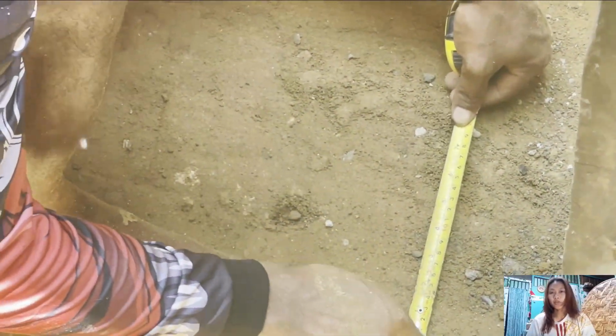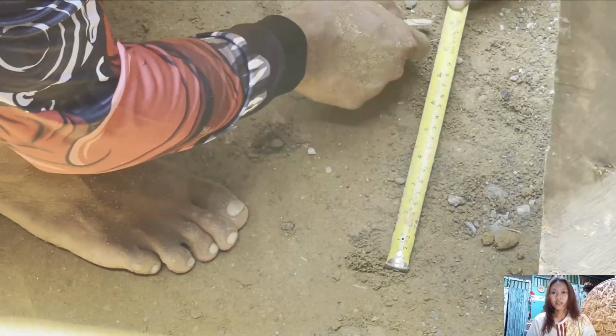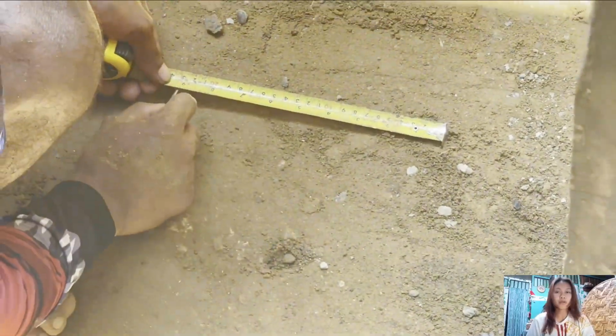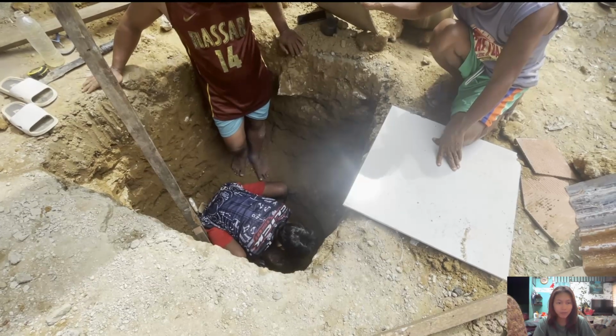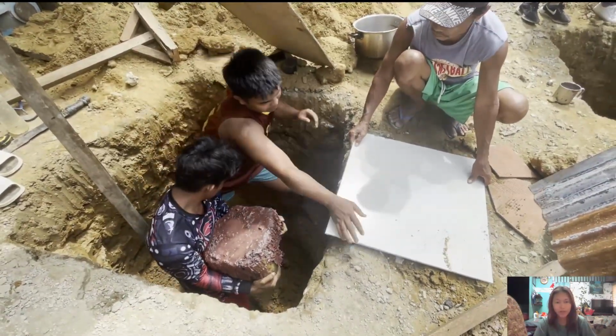After digging 1 meter below the natural grade line, we will outline 8 inch by 8 inch in the excavated depth for our undisturbed soil sample, providing area allowance for the undisturbed soil sample to avoid crumbling of our sample. Upon reaching the desired area and size for our undisturbed soil sample, carefully remove the undisturbed soil sample from the 1 meter excavated depth.